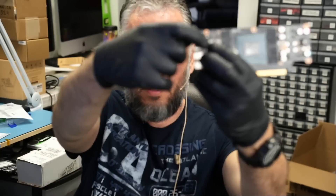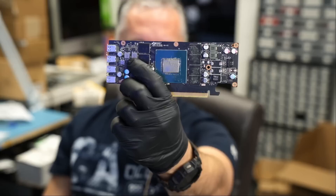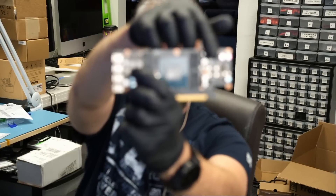Awesome! The second inductor on the left — the first one was reading 1.8 — I want to know what the second one reads: 0.96 — that's PEX. So PEX is reading 0.9 volts, the one next to it is 1.8, core is the black one reading 0.76, and the top ones are reading 1.2 volts each. All voltages are present — we're going to deem it 99.99% fixed.